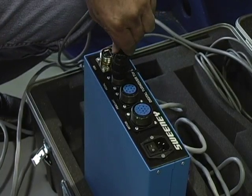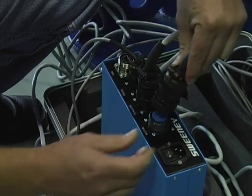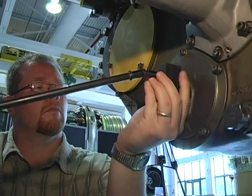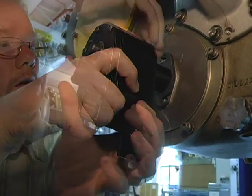Connect the motor cable, pendant cable, and the optional foot pedal to the respective connectors on the DTT controller. Connect the power cord to the power port and proper AC outlet. Mount the engine interface adapter on the respective drive pad of the engine gearbox.